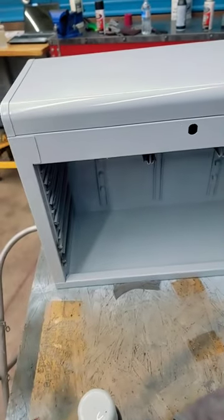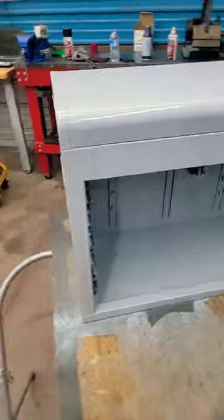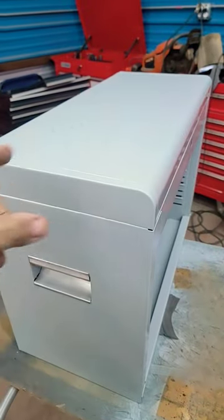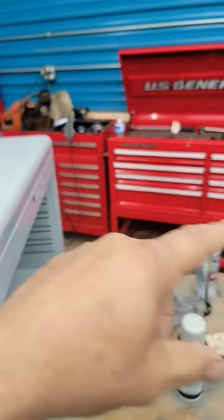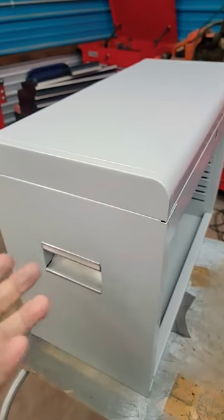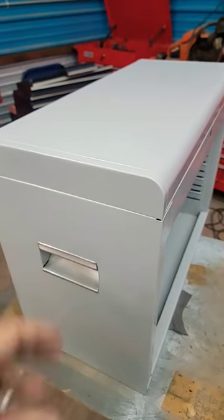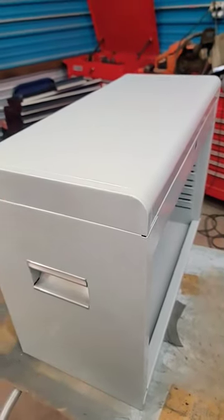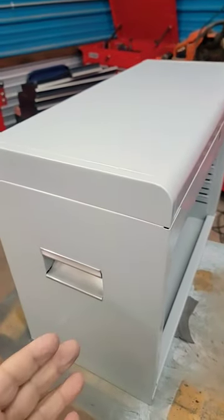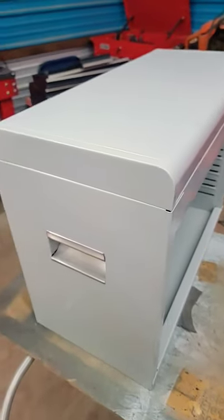I put three coats on the box. Put your first coat on — it goes on really thin. It's a fast coat. You can see the red in the background; that's the reflections from all the other toolboxes. Put your first coat on, give it a few minutes — ten minutes or so, depending on your temperature — to flash and become a little sticky. Then put your second coat, wait about 15 minutes, then put your third. Don't try to bear down on it too fast or it will run, because this stuff flows really well and it's thin. My suggestion is give it a few minutes.